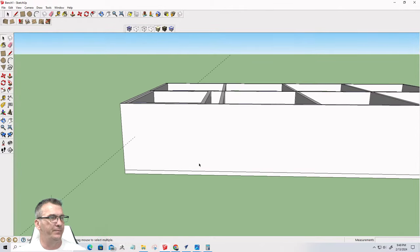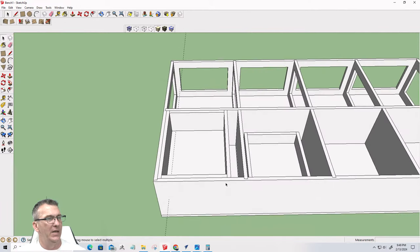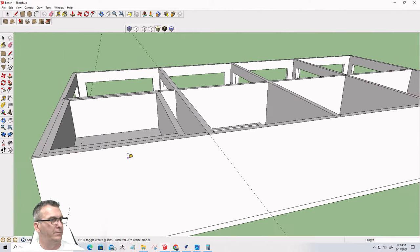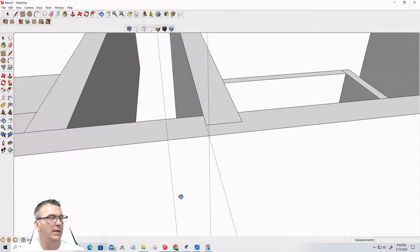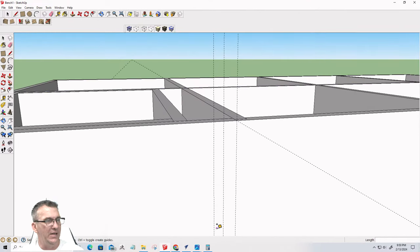My face frame and everything on the edges, just so you know what's going to go on here, I'll draw this first face frame. But from the inside edge, I'm going to have a face frame on a cabinet. No, I'm going to have a 3/4 inch overhang here. So what I want is, I need to move in, let me get my tape measure tool. I need to move in 3/4, 0.75. Remember, there's going to be a filler there on the inside, and then I'm going to have my 18/32 drawer slide, right? So 18/32, enter. And so this is where my opening is going to be.